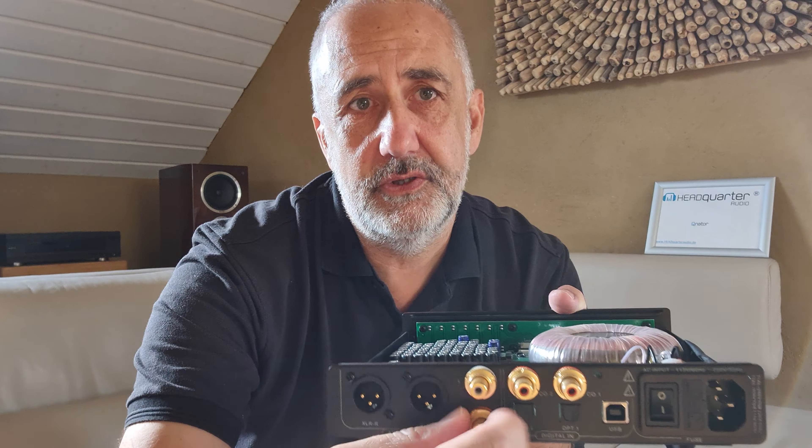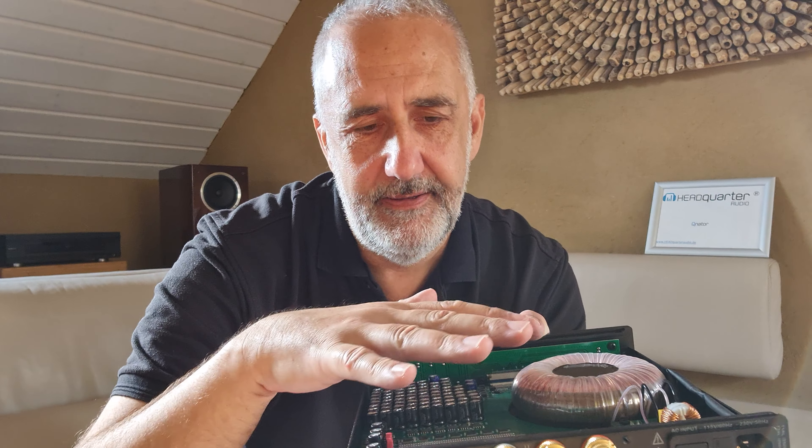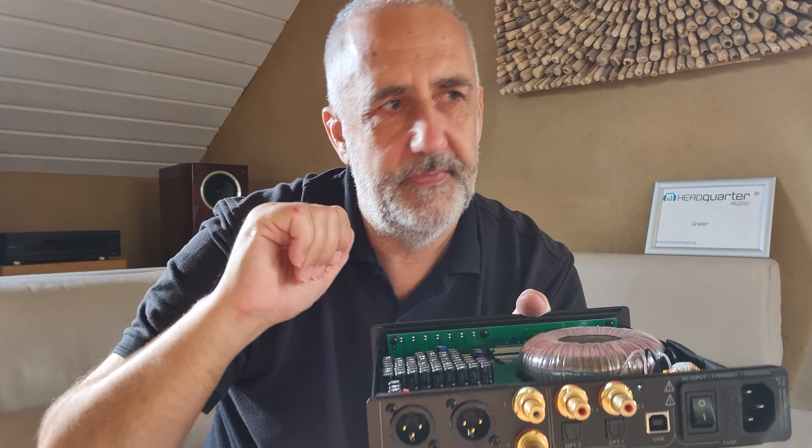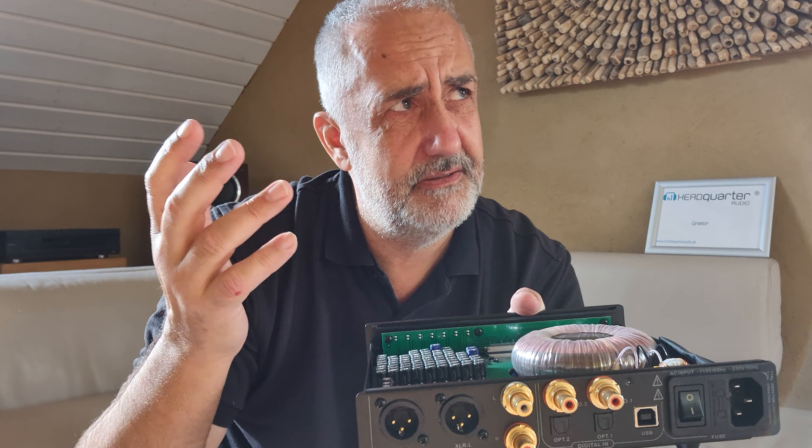You can see some brackets here — remove the screws of the cover lid and turn the one in the middle in again but without extreme force. That's important: no extreme force on any screw on the device. Just make contact with the plate and then a quarter turn more.